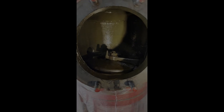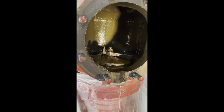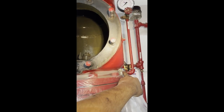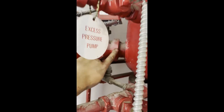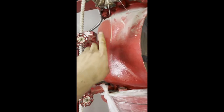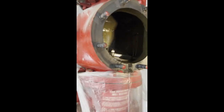I'll take this opportunity while doing a five-year internal obstruction investigation to show you the internal components of a wet alarm valve. Going over the outside first: we have a water supply port here, another water supply port — a quarter-inch one — and a half-inch port. We have a system side main drain port on the side, a system side half-inch port on the right, and another port which is plugged off — that's just another system side quarter-inch gauge port.